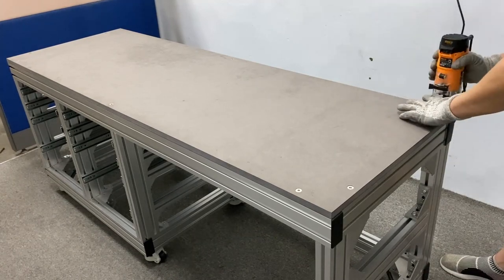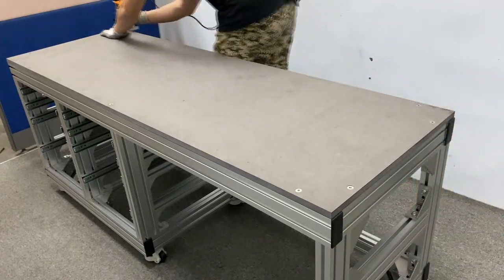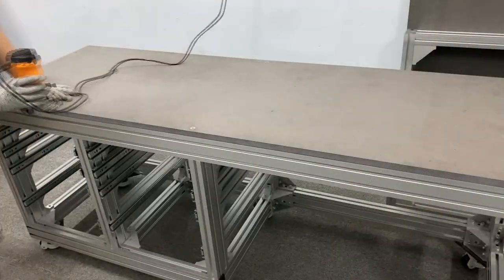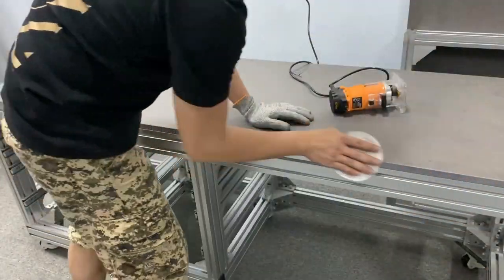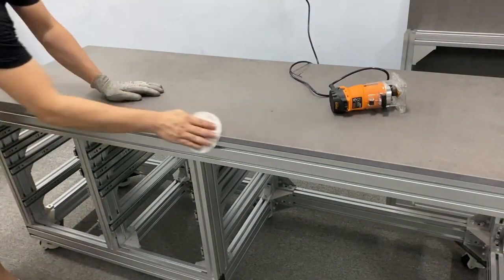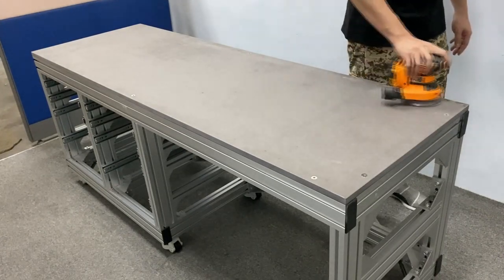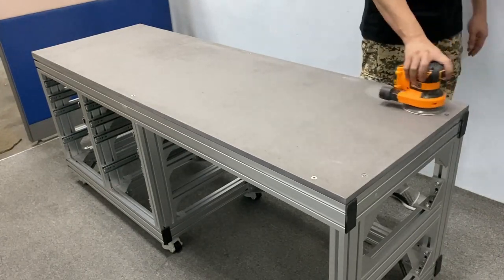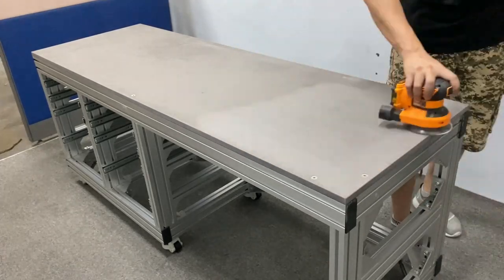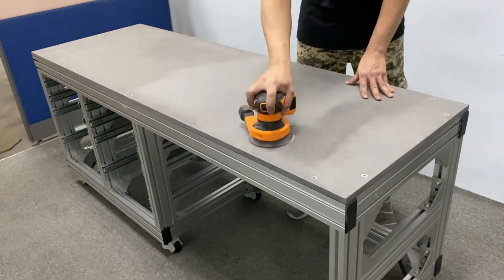Over here, I put on a 45 degree bevel on all sides, and hand sanded it down to get it smooth. The surface received a good sand from 320 grit to 600 grit to 2000 grit machine sand. The end result is as smooth as acrylic.